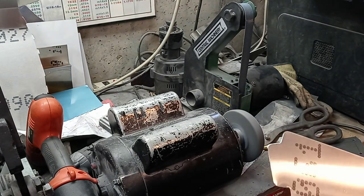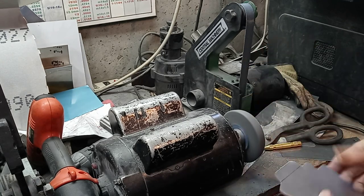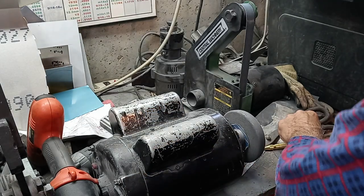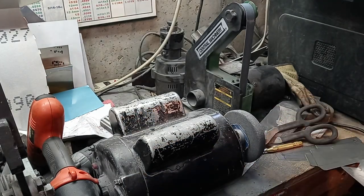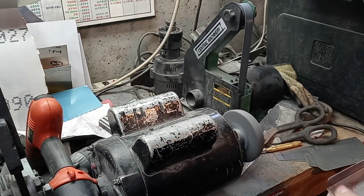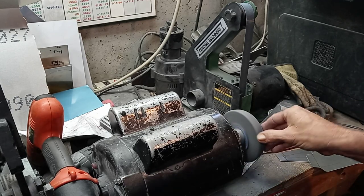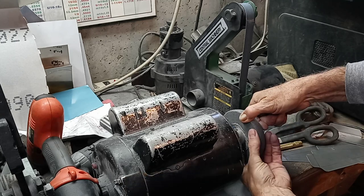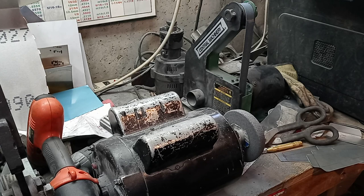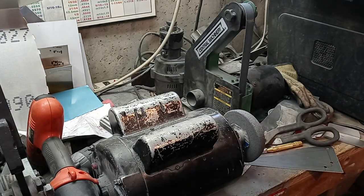Now, obviously, just like a grinder or something, since this is turning this way, you don't want to stick this in there like that. I'll show you what'll happen. No, I'm not, because it'll dig. This thing is really kind of rubbery, and it'll dig in and put a gouge in there. And I thought, no, I don't want that. So, okay. Now on to the next.